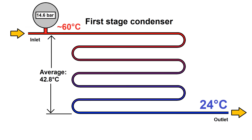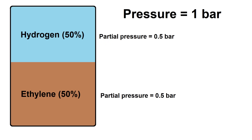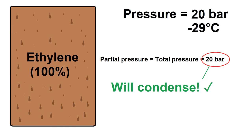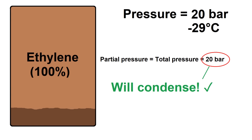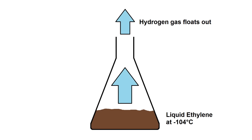The second problem is that the ethylene I've produced is probably contaminated with hydrogen, since I ran my catalyst on the hot side. The condensation and evaporation is based on the partial pressure of the refrigerant, so for example, if only 50% of the mixture was ethylene, the partial pressure would be divided by two. In that case, if you were at a temperature where the ethylene would condense at 20 bar, the total pressure with a 50% mixture would need to be 40 bar to condense, which obviously isn't practical at all. Before proceeding any further, I need to purify my ethylene and remove any hydrogen gas that's diluting it. To do this, I'd need to liquefy the ethylene and then open it up to the atmosphere, which would cause the hydrogen gas to float away, leaving pure ethylene behind.